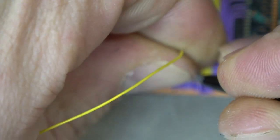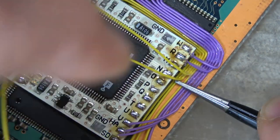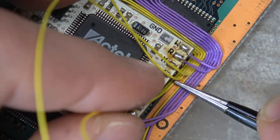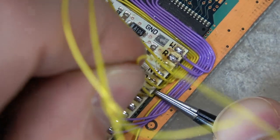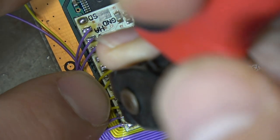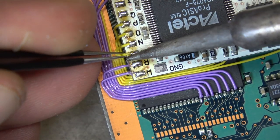Those were my worst two joints of the whole install, but now I'll fast-forward through the rest. If you saw my other PS2 videos, you'll notice I do different styles — wires underneath the chip, wires that bend in curves, right angles. It's about mixing all these techniques in different situations. But none of this wire management actually matters as long as you have a good solid solder joint. That's what matters.